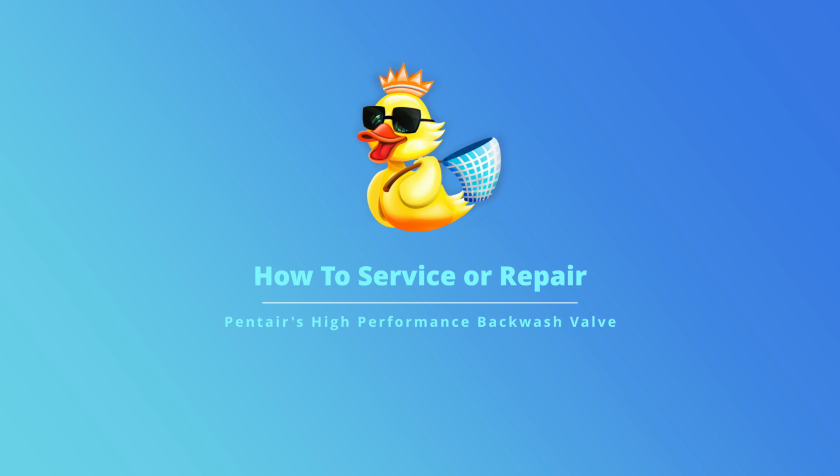So what we're going to do, you see here on both faces of this, and then the paddle down there has O-rings that we're going to lube up and clean up, so that way this becomes easy to turn during normal operation. So we're going to go ahead and get that taken care of right now. All right, so now we got the pieces out. The most important thing is we're going to wipe down in here and get rid of all the gunk and sticky stuff down here from old lube worn out. So we're going to go ahead and just take a towel, clean this out really nice. That way we're not keeping gummed up stuff in there when we put the valves back in.